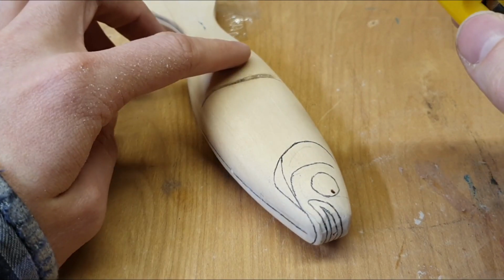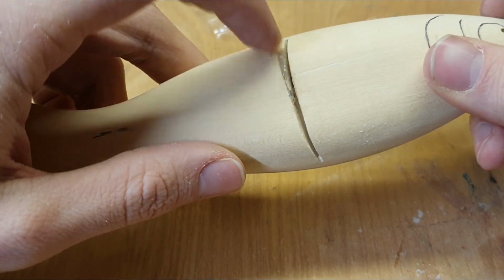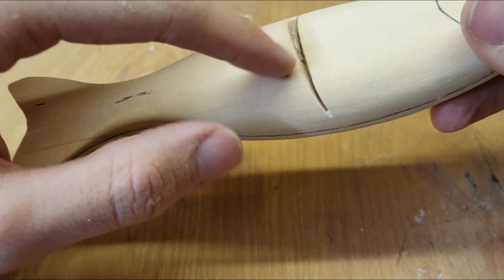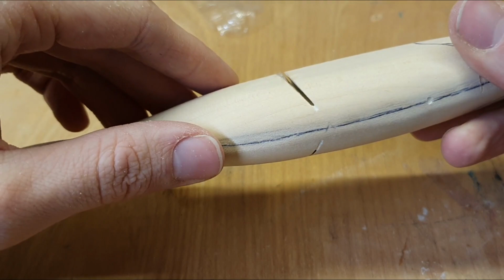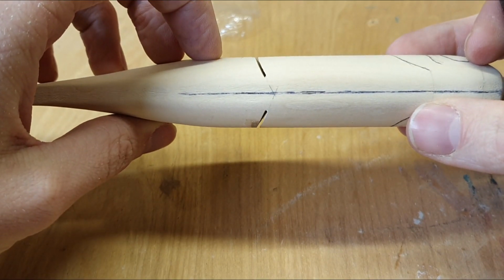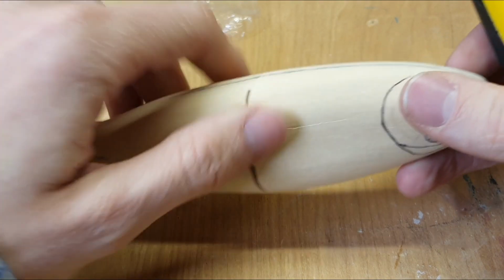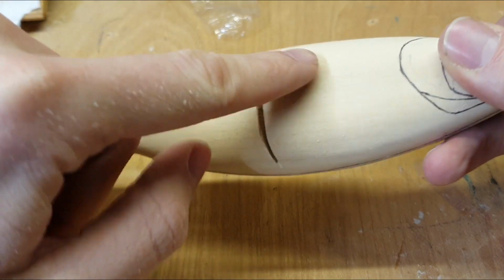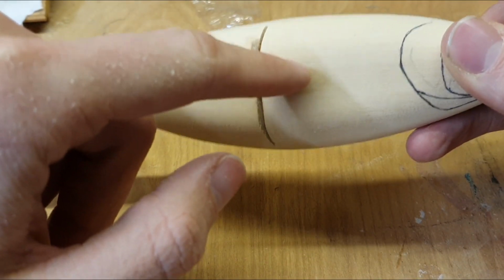But also another thing that I did, just mixed up some sawdust from sanding it, like the real fine dust, mixed that together with some super glue, and then just pasted it in there, and now just sanded that flush. So yeah, there you go. So that's all sorted, and then this little crack here will just get filled in when I waterproof it and everything, so I'm not really too fussed about that.